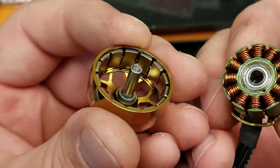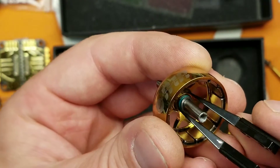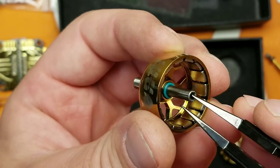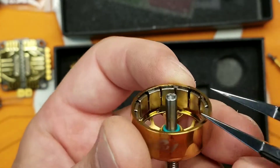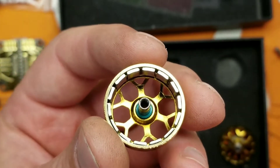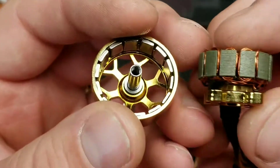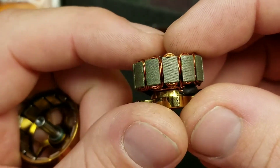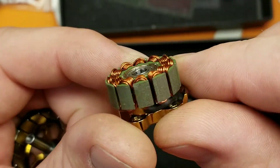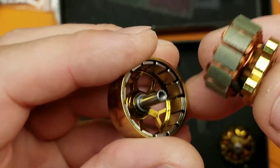There's the motor bell — it does have that little O-ring in there, like the iFlight motors, along with a little shim. That O-ring allows you to just crank the screw down without worrying about preload. These are looking more and more like the same construction as the iFlight Xing motors. This commands a premium price — you can get the motors and ESC individually or as a set, and you save a couple bucks doing it as a set. Nice big bearings and nice laminations.